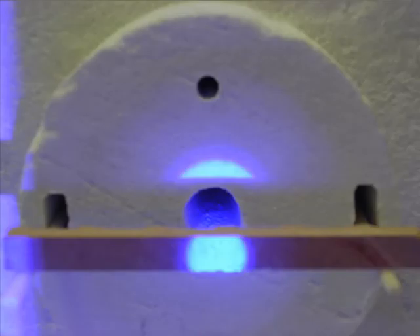The sample is a small bar long enough to be held by the sample holding rods, which are spaced 70mm. If the test is carried out on a green sample which is going to shrink during the firing, it is necessary to take into account the contraction in order to avoid that the sample may fall from the sample holders. The sample needed for the coupling temperature is simply a bar of glazed material which can be cut directly from a specimen of fired material. It is not necessary to prepare a specific specimen made on purpose for the test, like in the old Steger tensiometer.